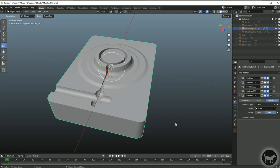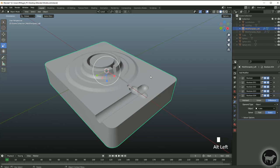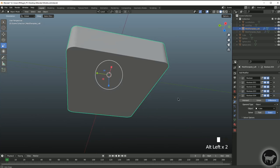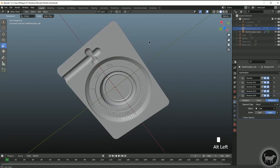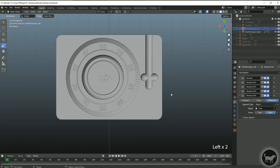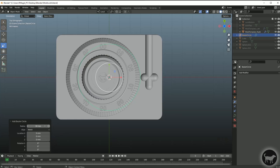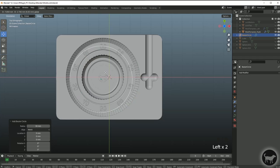On this version, I'm going to have the channels come in the back through the center hole, do a radial turn around that mold, then have a vent that comes out the other back. That way, there's never any chance that plastic injected into the top can get to any of those other sections. If I ever overfill the mold, I don't ruin my mold and that entire cooling system. So I'll come back into Blender, go to Add, Curve, Circle. Right now I have a 30 millimeter circle, which I think is fine.